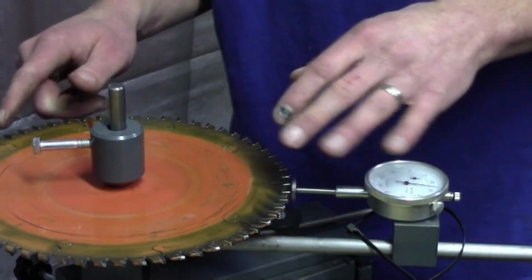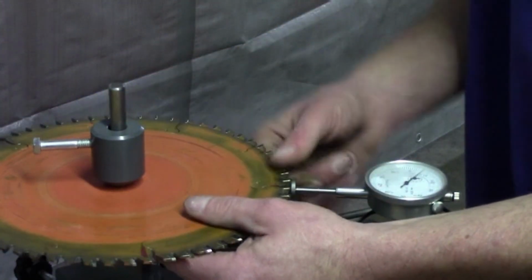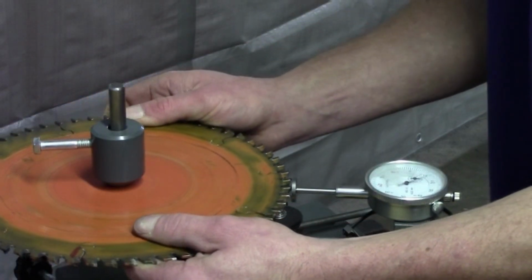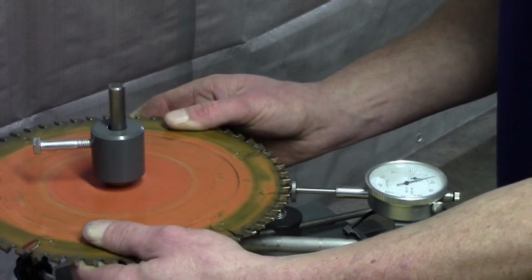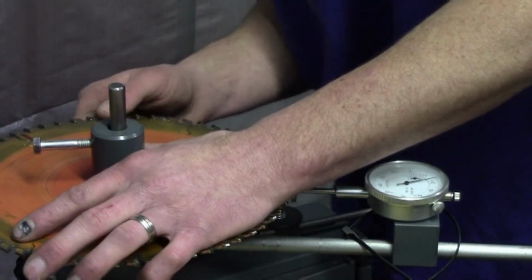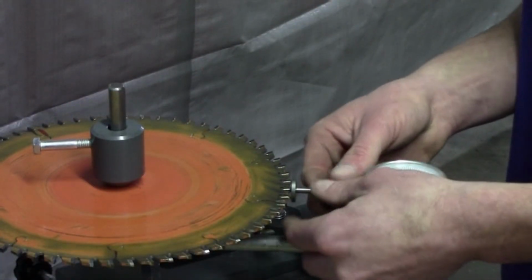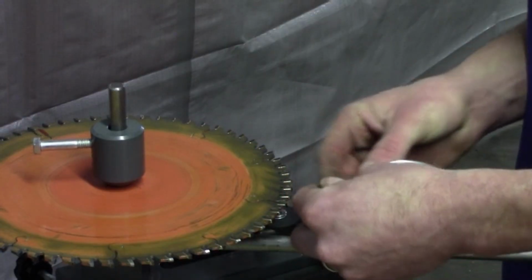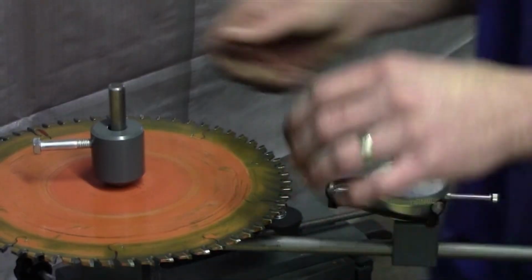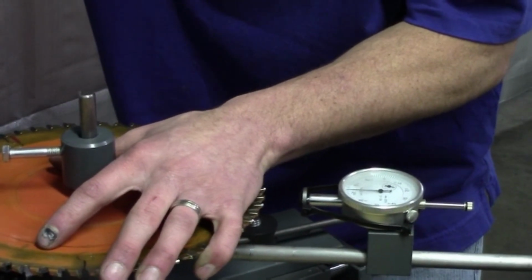So before I do any of those flat 45s, I'm going to do that raker. Bring it around here, and I'm just going to check. Yep, 25, 17, right around there. So I'm not going to change any of my setups. And I'd like to lock that back up. And now I'm just going to move my motor in to do my raker teeth.